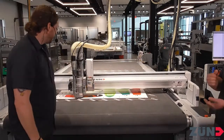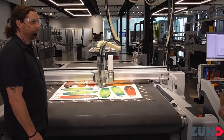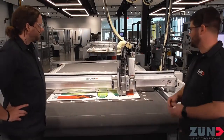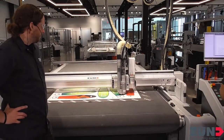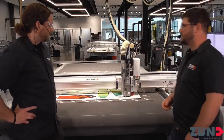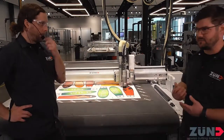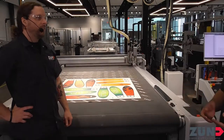How is this router cooled? This one is liquid cooled — our one kilowatt router is air cooled, but this one has an external cooling unit that pumps cold liquid through it to keep the spindle at the correct temperature. We also have the MQL — Minimal Quantity Lubrication system. This hose squirts just a small amount of oil onto the bit. If we're routing pure aluminum with these 500 series bits, we don't necessarily need it, but it helps keep friction down.